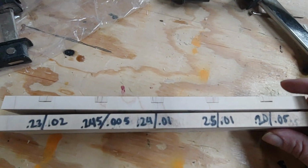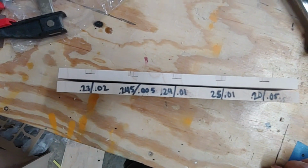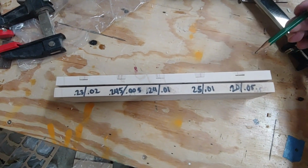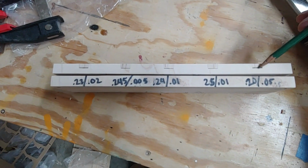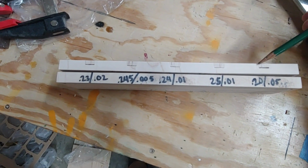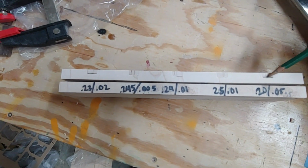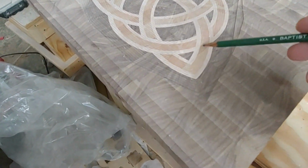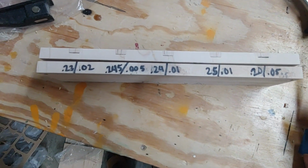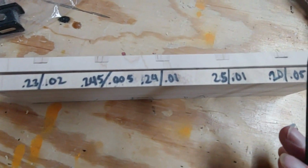All right, so there we go. Sorry for those of you that wanted to see a shot of me working a table saw, but I'm trying to keep this mainly about numbers and not about working machines. So there were the original settings I was using, and you can see it's got the biggest pocket underneath of all of them because the sides started hitting a lot earlier. It may not look like a big deal, but when you're trying to do something this big, I ended up with voids underneath there. I could probably pour a ton of glue in there, but I don't feel like that's good for the longevity of a cutting board.